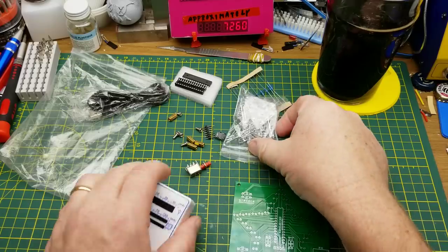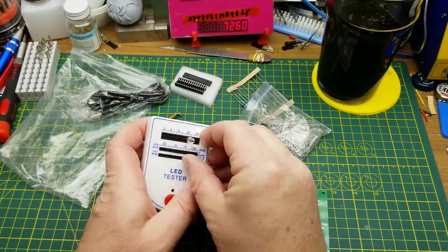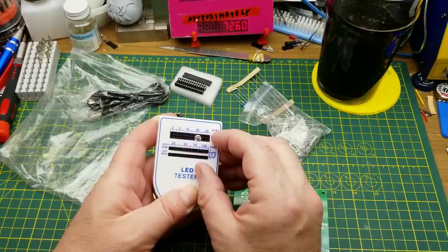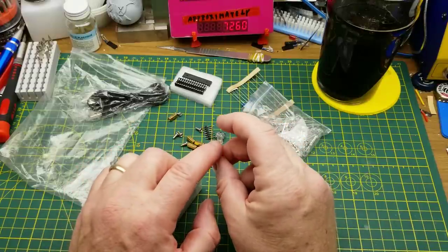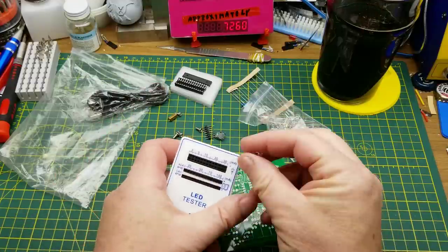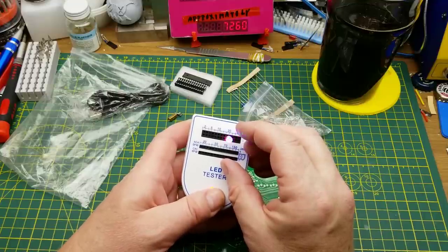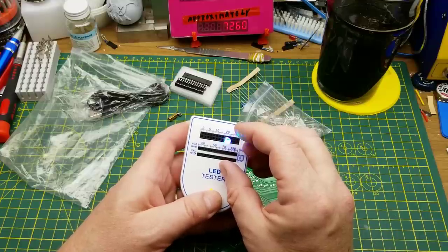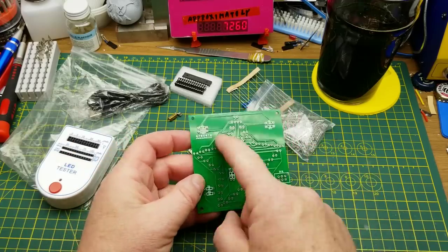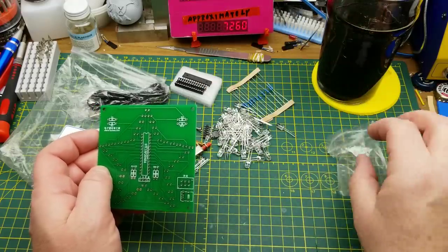So it says that these are colorful LEDs, or RGB LEDs, which I assume means they're going to be the self-flashing ones again. Yep. A medium, a slow, and then a fast. But it's probably never going to get to that fast stage, because these are going to be cycling through so quickly. So it'll start with the first color and maybe get into the second one or the third one. So it'll probably never get past that part of the sequence, which is okay. That allows them to get a whole bunch of color without having to address them as RGB. And these are relatively cheap compared to the NeoPixel-style addressable LEDs.